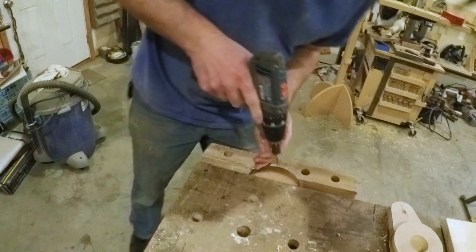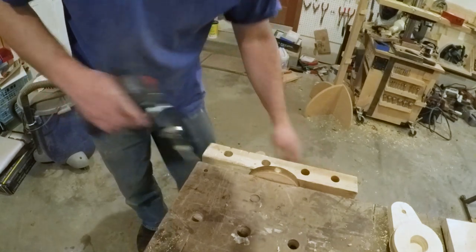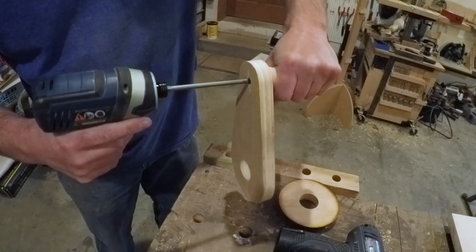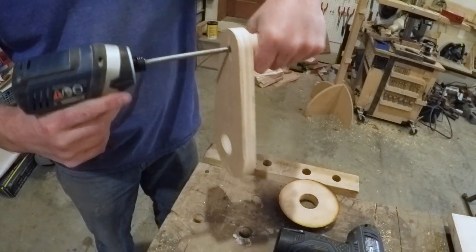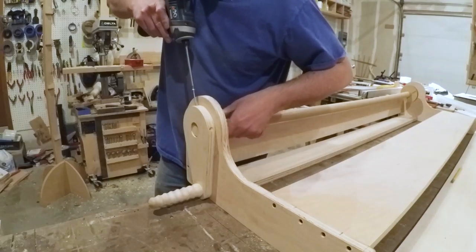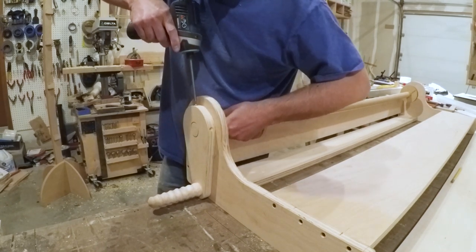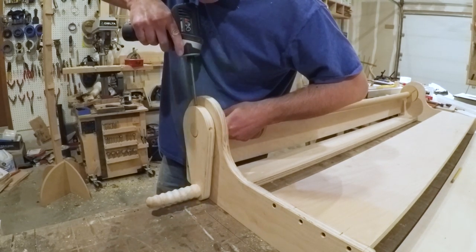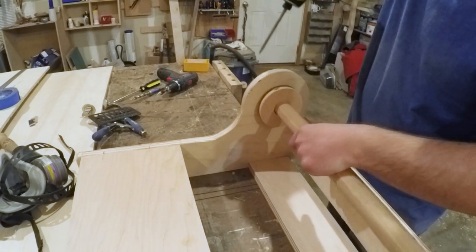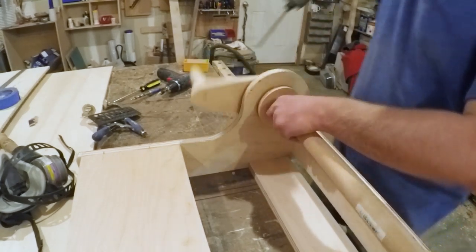Before assembly of the handle I pre-drilled and countersunk through the edge of the plywood so I could add a set screw to attach the closet rod to the handle and the keeper rings. I screwed the handle in place being sure it wasn't too tight that it wouldn't spin. I put the closet rod in place and added the set screw to attach the handle to the rod. On the other side I left about an eighth-inch gap between the side and the keeper ring and screwed it in place — that gap will help everything spin nicely and keep the rod from sliding out of the jig when in use.